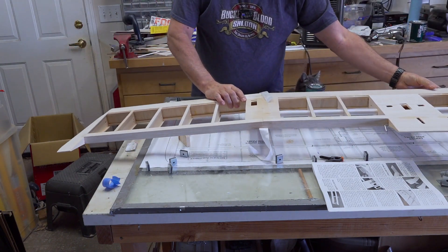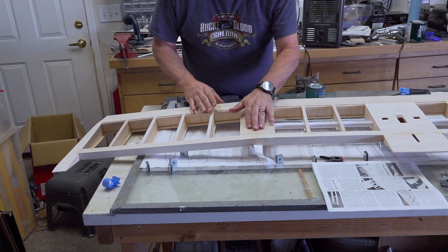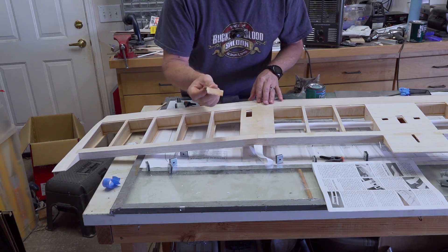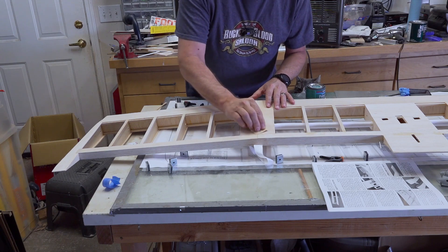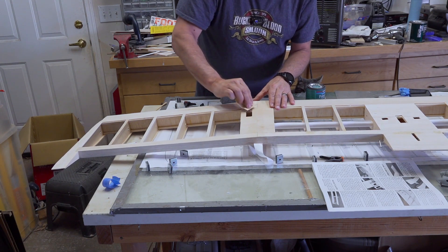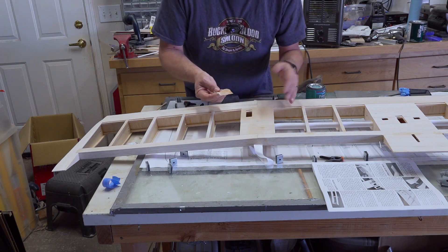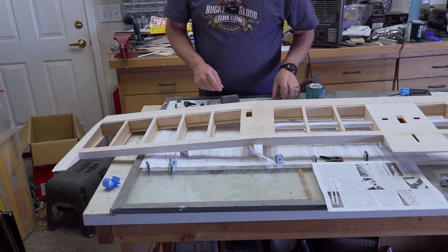This is the bottom side — when I ran my hand over it, it did raise the grain just a little but not much, it is a bit rough. What you want to do after laying down that first coat is take some 100-grit sandpaper and just run it over there. I'm running it against the grain — all I want to do is smooth it out just a tiny bit, knock down any dust particles or sawdust that might have got under it. It doesn't take much effort; just in what I did here it already feels really darn smooth.